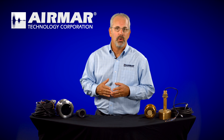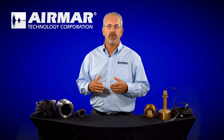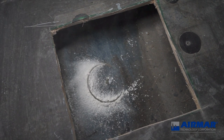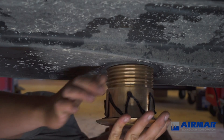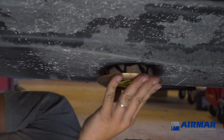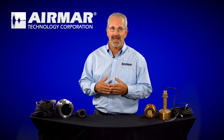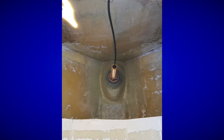For a larger boat or something with inboards, you'll hear the term through-hull transducer. At Airmar, when we say a through-hull transducer, we mean just that — a hole is drilled through the hull and there's a stem that goes through it, with the face of the transducer sticking outside the hull, often paired with a fairing block. True through-hull transducers are made with bronze housings, sometimes stainless steel, or even plastic depending on the hull type.